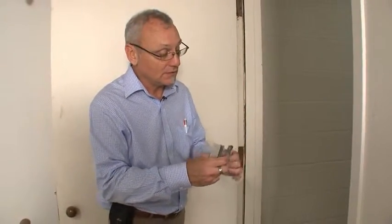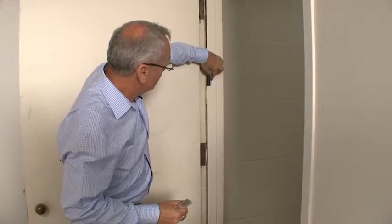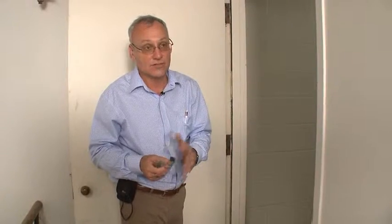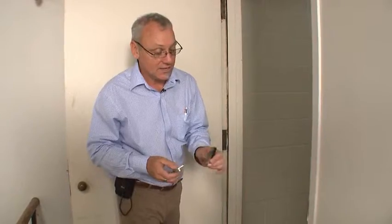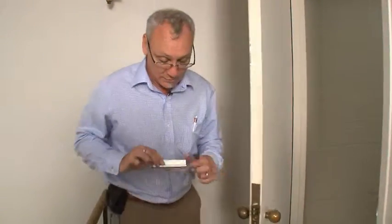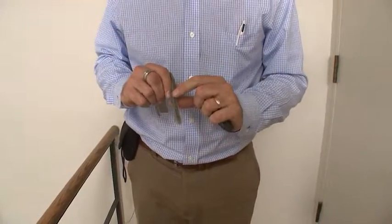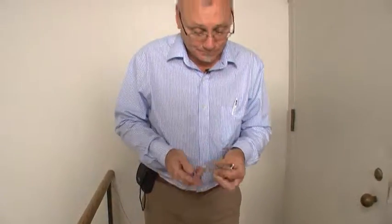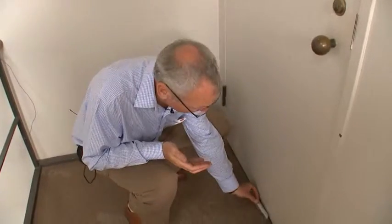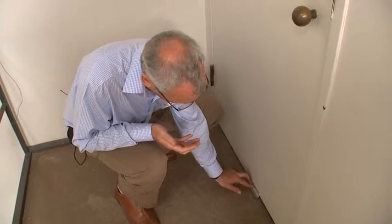To rectify that issue, we use a compression seal door set that sits on the side of the door — the door closes into it and creates a 25 to 30 percent compression. If you compressed it right across it wouldn't fluctuate with the warping of the door from season to season due to temperature, moisture, and humidity. That goes on three sides — two sides and the top. On the bottom we use a door bottom sweep, which is a polypropylene product with a double fin that acts as both a moisture and air barrier. It's compressed just enough that you hear the whooshing of the fin to create the seal.